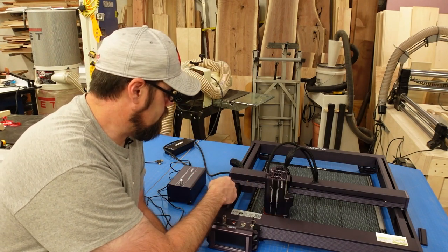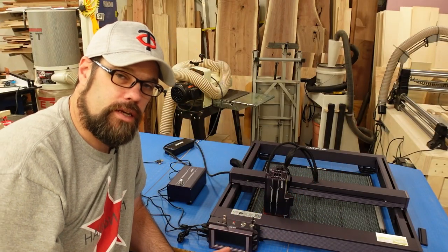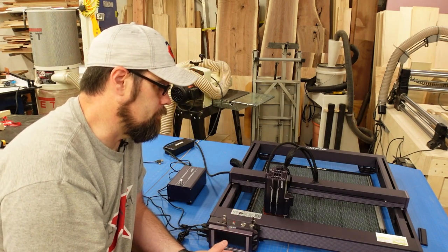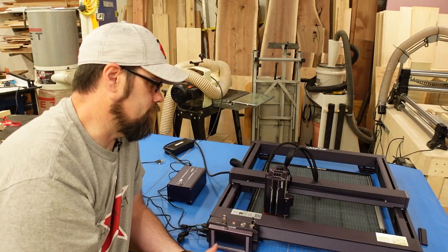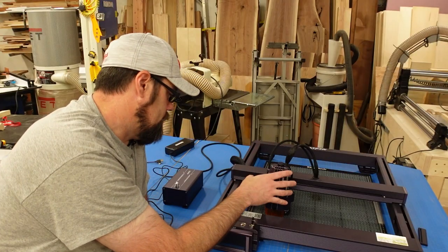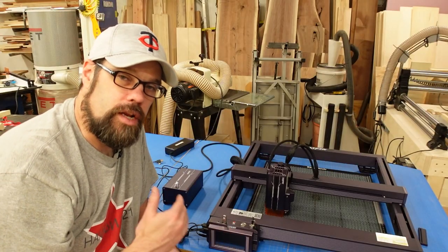The linear rails are something I was really excited about. They provide a cover that the bracket slides through, which helps protect from dust and debris, but you'll want to keep an eye on the side rails and wipe them down as debris builds up. The cover comes off with just a few screws for servicing. When assembling mine, I noticed a little play in the module — there are screws on the bottom of the rails you can tighten. One was slightly loose; once snugged up, the play went away immediately.